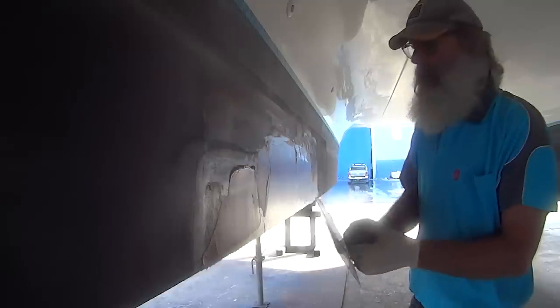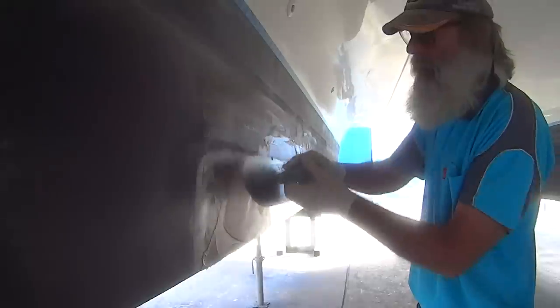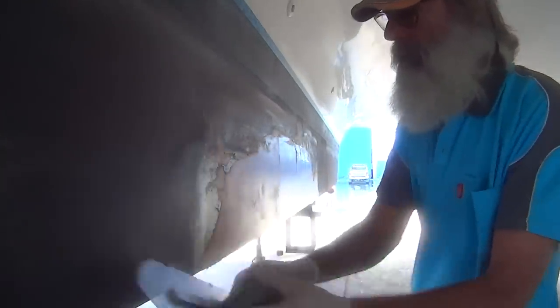We're putting wet on wet, basically. You'll just allow it to go off, but still be tacky, and that'll give a much better bond.